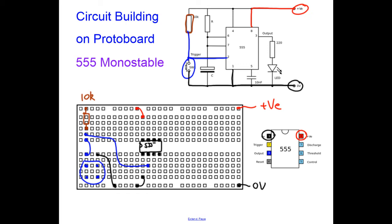The next components are the timing components, which I'm drawing in green. This is my capacitor and my resistor — I'm drawing the resistor in green rather than normal brown because it's a timing resistor to highlight that. I'll label them R and C and connect them together with a piece of green wire. C connects directly to 0V with no extra wire. R and C both go to pin 6 and pin 7 — take a wire to pin 6 or 7, then connect pin 6 and pin 7 together using the same green wire. That is my timing components connected.